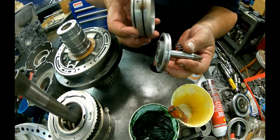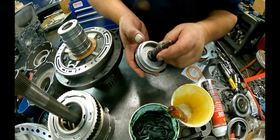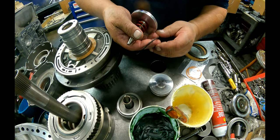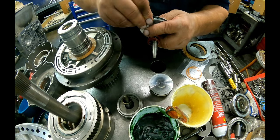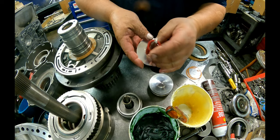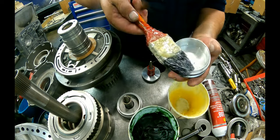It's a B. Takes an O-ring there. Takes two flat O-rings here. Goes in there. And our return spring on top. We're putting in a super servo. It's an A plus. It has this flat rubber that goes here. That's kind of actually a D-shaped rubber. And our return spring has got two of those flat lathe cut seals here. You see how much bigger it is.